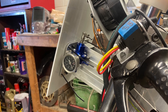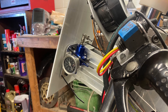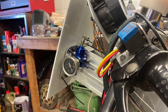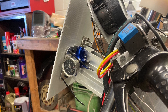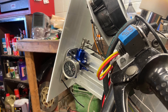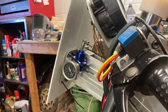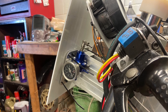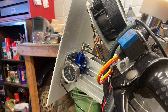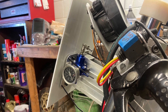Here it is mounted to the bracket for the number board. That bracket is very flimsy — it's only 2mm aluminium — but once it's bolted to the chassis there are big lugs in the front of the steering head. It's solid; it's strong enough to lift the bike, so it's about 80 kilos on the front. It's quite a lump and it's strong, so this little piece fits in there really nicely. I've got the number board, which is a bit of corebond, just loosely cable tied to the front of it.